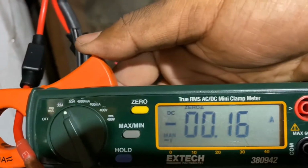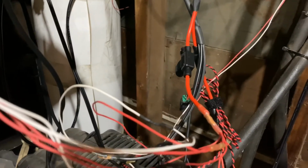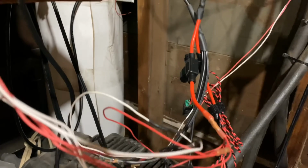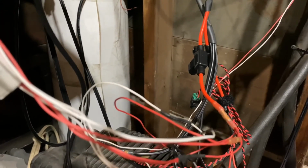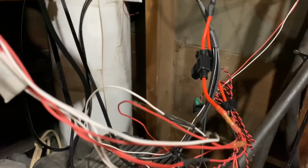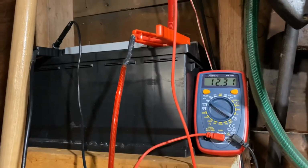The sensors are pulling almost no current. So what that means is the charger is charging about 1 amp hour, and it's draining about 5.5 amp hour, and it can charge all day, and it will work off the battery. That's with all 3 lights on.